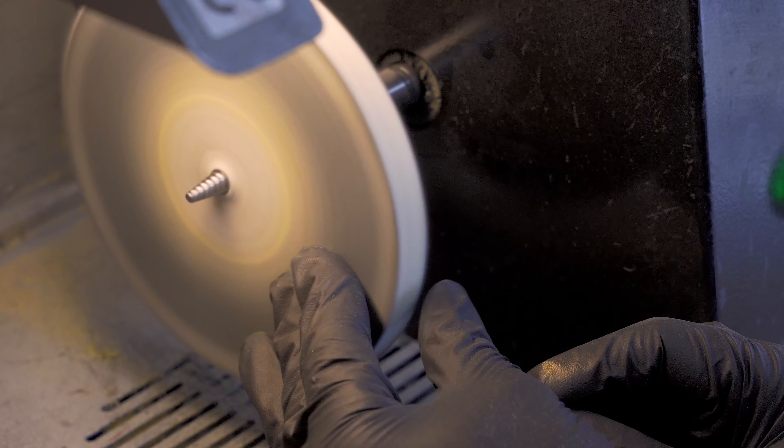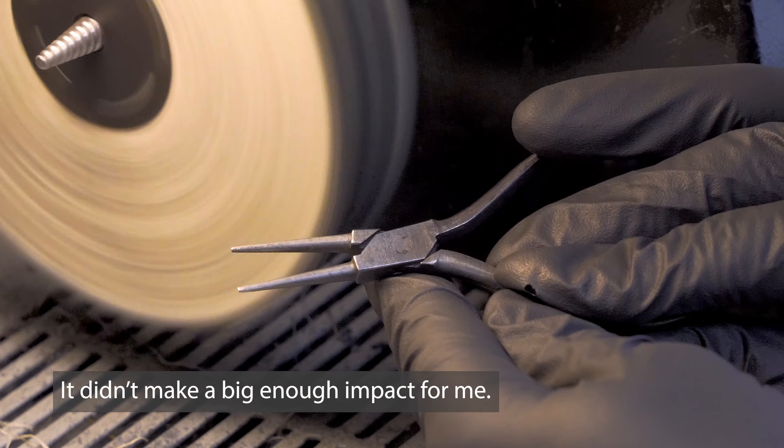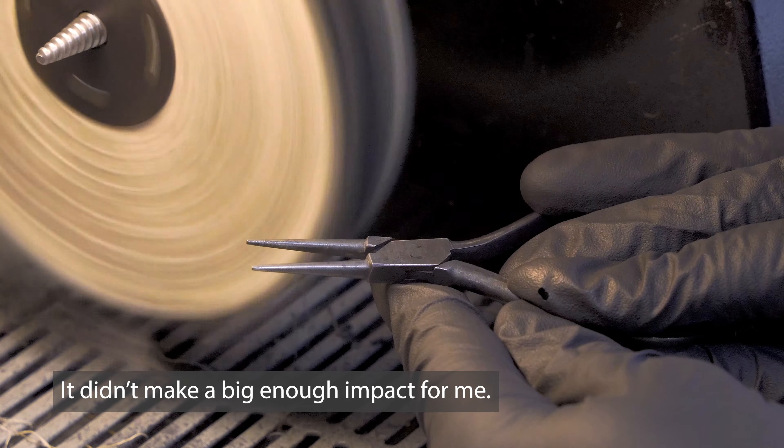On platinum, this is really where you're going to see it shine. I've watched a few videos on this and people say they use it for tool polish with great results. I find that if I take a piece, prepare it with sandpaper, and then go onto the normal stitch mops, it almost gives me a better result. With all the mops we've got, the Sisal one is a little bit rugged for my personal workshop — but you might have a different experience.